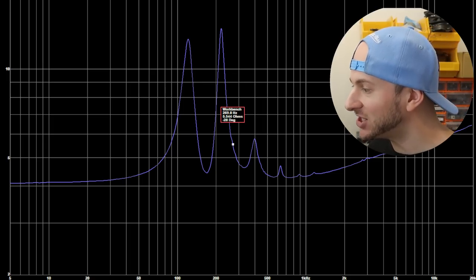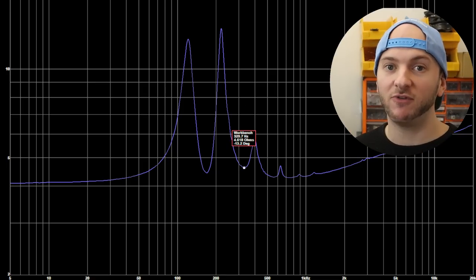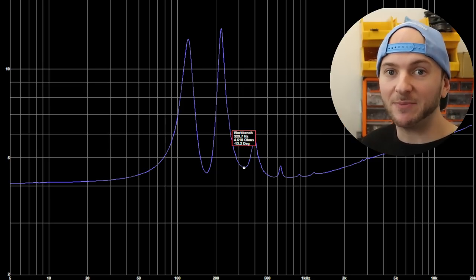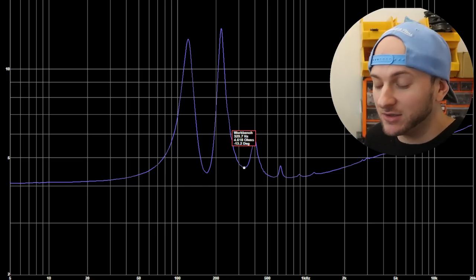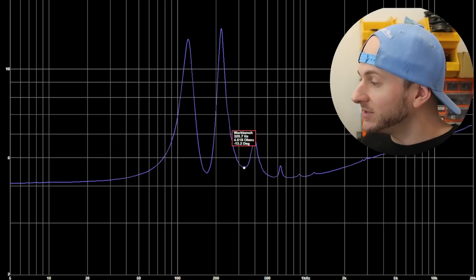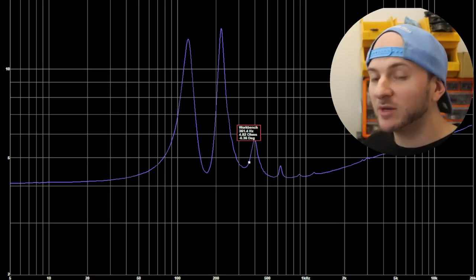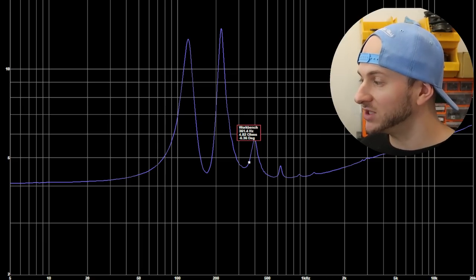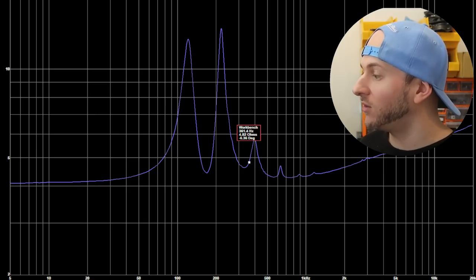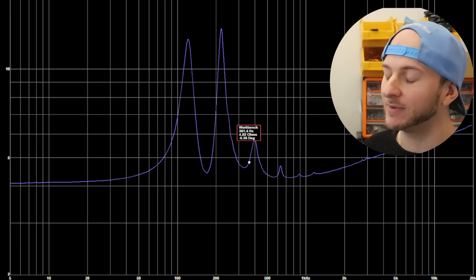The next dip is actually at 325 hertz, which is sort of somewhere in between the last two frequencies we test, 270 and 360. So this second impedance dip signifies the second harmonic, the second fundamental frequency that this horn is going to load the cone at. And our last frequency, like I say, is 360 hertz, which is just after the impedance dip here, so we're going to be loaded well at both those two last frequencies, which I think is a good thing, because I think this is going to be relatively flat across the board. We're quite well loaded at the two top frequencies and the lowest frequency, with the only one with a bit of unloading being the 33 in the middle.